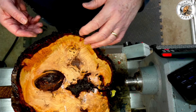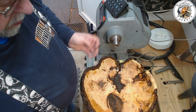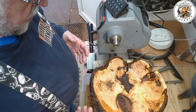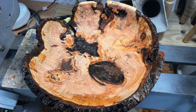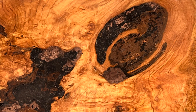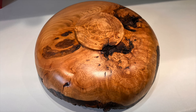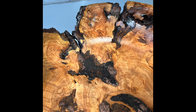I've just got to let it dry overnight and hopefully it will be okay, then sand it up and see what it looks like. The super glue and filling operations took place over a couple of days, and then sealed with a sanding sealer and three coats of satin lacquer cut back between each one.